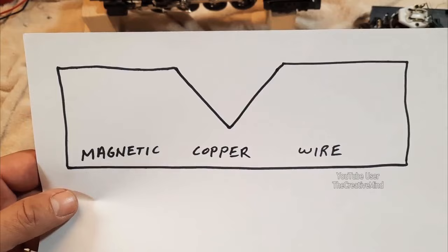I'm going to peel this guy off — I guess this one was more brittle than I realized. So it's a good thing it's a donor motor. To find the gauge of this wire, I have this stainless steel wire gauge from Amazon. If you take off a little bit of the enamel, we're going to put it through one of these slots to see which one is the right gauge. It's not 25 — it definitely feels like it's 24 gauge.